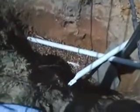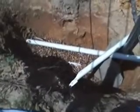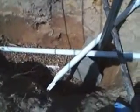Alright, now, what we've done here so far, as you can see, we've got the gravel down in there. We've got the pipe just exposed a little bit. This could honestly use quite a bit more gravel, but I don't really have a whole lot more gravel. Let's see if I can scrounge up some more stuff before we fill this in. But I've got the yard hydrant attached there. It's pretty much plumb. I've made those adjustments already.